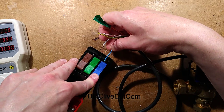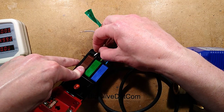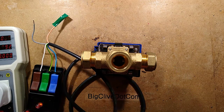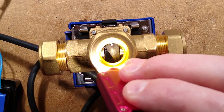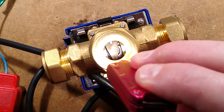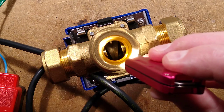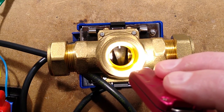So now I'm going to put the blue wire — the neutral — into here, and the earth wire into here. If I put the white wire in on its own, it should go to the mid position, and I'll show you that. I'm going to zoom down on this. You can see the little rubber deflector there. If I power it up, that is slowly winding to a semi-mid position, then it cuts off, allowing water to flow both ways. It's notable that it's left a wider gap at the radiator side versus the hot water tank side, simply because less water would be required there. When I power it off, it returns under spring pressure.